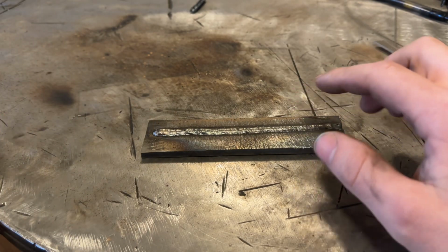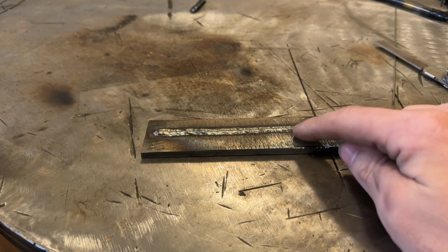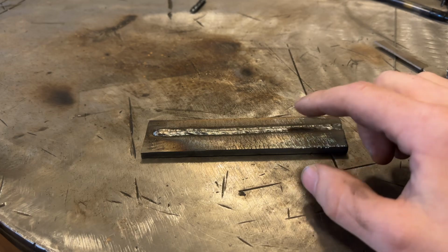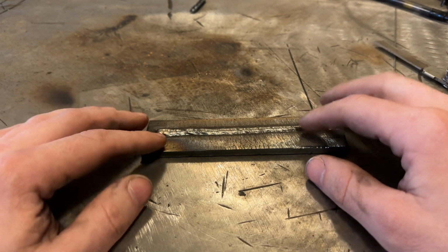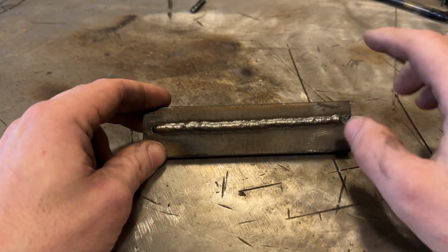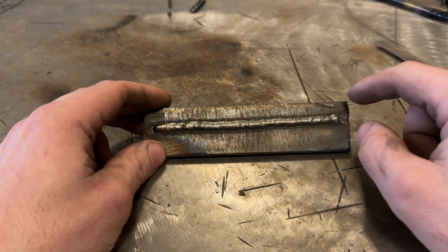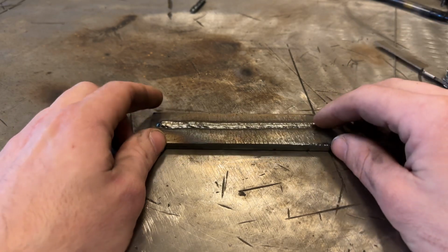Not only does it help with the wear, but you don't really want to be putting like a million beads and layering this, generally speaking, especially the single pass rods, because of the previously mentioned brittleness problems. So spacing out in an X pattern is a great way to get the wear resistance that you need, the dirt trapping capability, without putting excessive heat or metal on it.